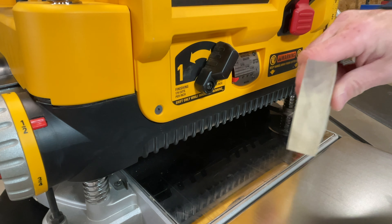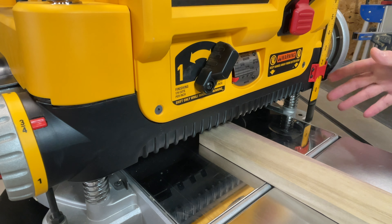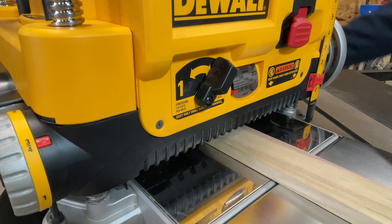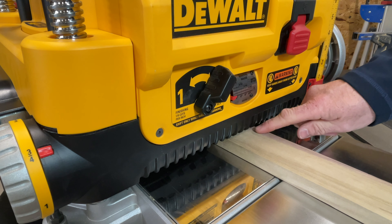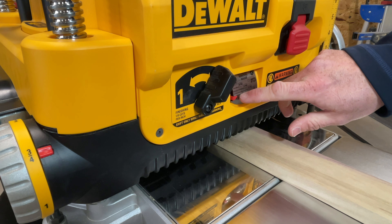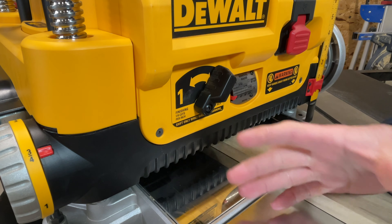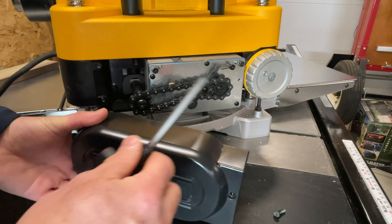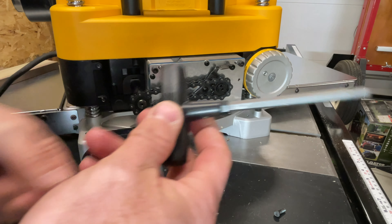So how does the carriage stop work? This piece of scrap wood is three-quarters of an inch thick, but let's pretend for a second that it's one inch thick. So what we would do is crank the carriage up to about an inch and three-quarters, and set our carriage stop to three-quarters. We would bring this down to its thickness of one inch so we could start planing it, and we would do cut after cut. After a few passes, we'd run it down to almost three-quarters of an inch. Before we get past three-quarters of an inch, this stops and I can't go any further. The machine has stopped at three-quarters of an inch, and now we have a three-quarters of an inch board. So if we do a whole bunch of them at once and we're not really paying attention, this will save us from going past the thickness we want.